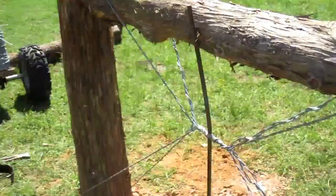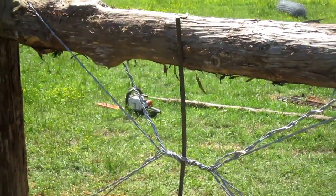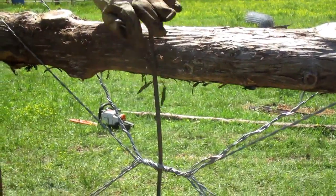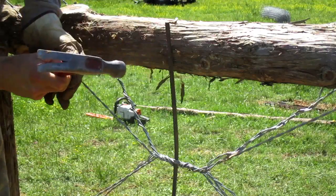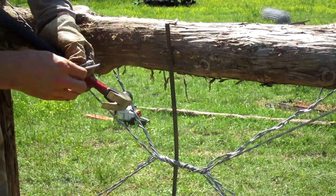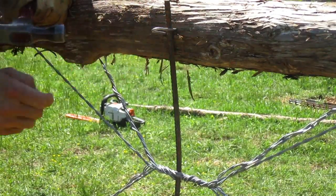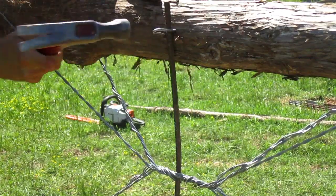And then I'm gonna go ahead and attach a staple right there. So we'll take the staple and put it right here in this part, so that way it doesn't go anywhere. And the one thing I always like to do is take the staples and put them at a little bit of an angle. So, you know, don't just stick it straight in here like this, because it can actually cause a split in the board. So I take it at a little bit of an angle, so that way both points aren't hitting the same spot.